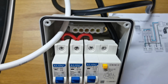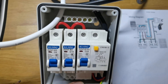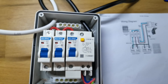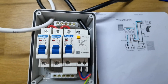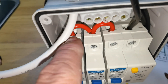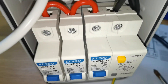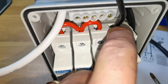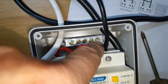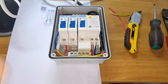Let's recap. Live and neutral in, making the main breaker live. The live from the top goes to both switches making them live, then the live coming out goes to lighting or a plug socket depending which one. I've just connected the neutral bar — make sure when you do it that the connections are secure when you wind the little screws down: slide them in from the top, don't miss them, and make sure they're tight. I'm putting the black wire into what becomes the neutral bar, so all my neutrals go to that one.